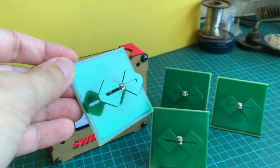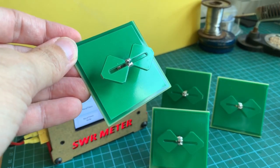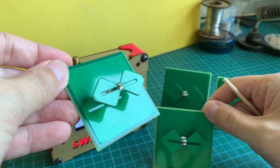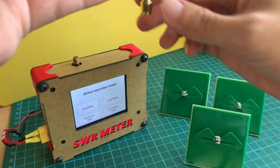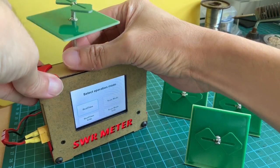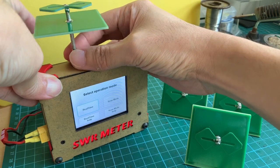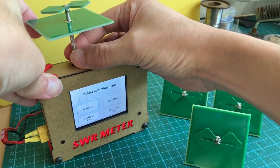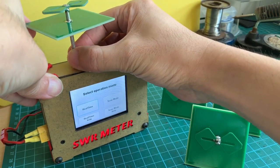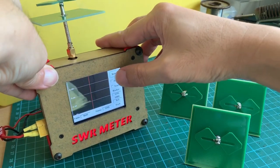We need four of these for our DJI goggles, and for the Byte Frost if you have one as well. Now it's time to test — specifically I'm trying to measure the SWR (standing wave ratio) to make sure it's functioning properly. Let me get into scan mode and do a scan.